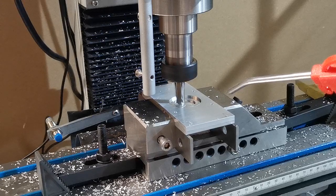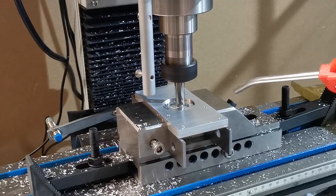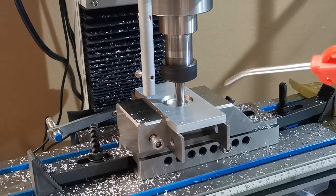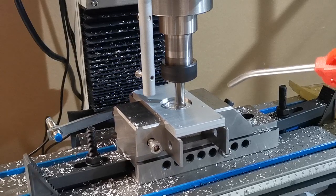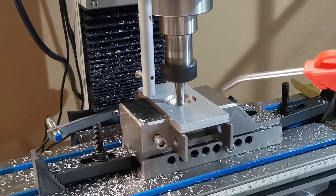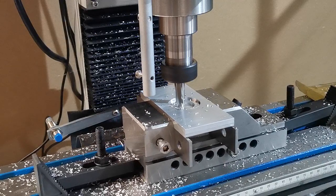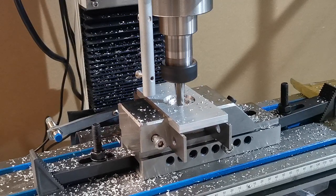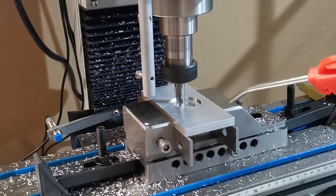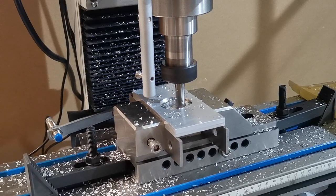It's never nice re-cutting chips you've already cut, so I'll keep the airline on. Looking at all our other videos, we always use air assist on all our production machines. You can see these are good sized chips — and chips like this actually take away a lot of the heat from the part.